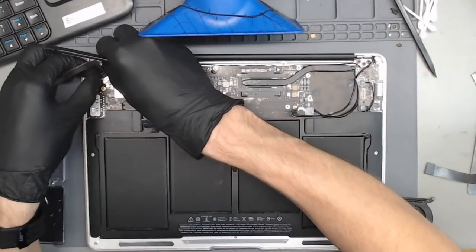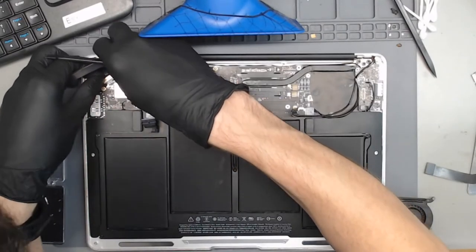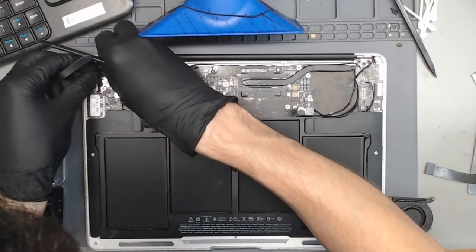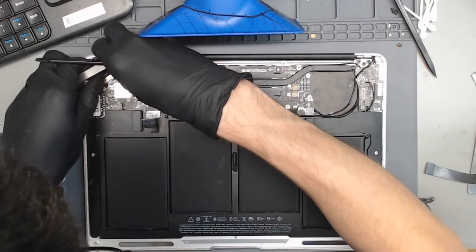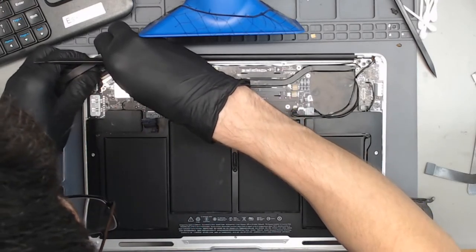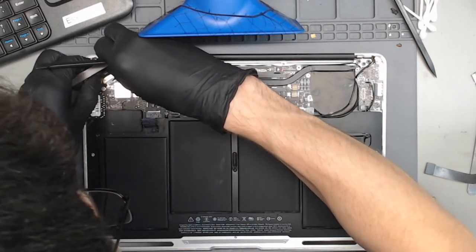I've also had a lot more people come in lately with MacBook Airs that aren't wanting to turn on because of a little bit of liquid damage on the IPD connector. It almost seems like there are cases where people are liquid damaging their trackpad from cleaning.